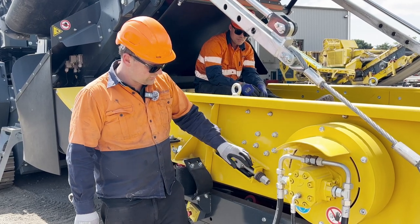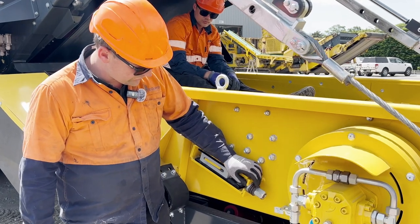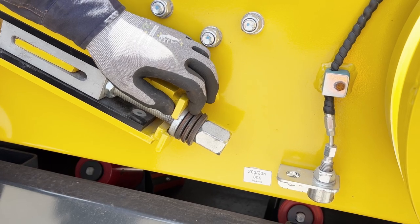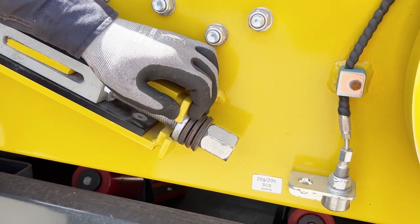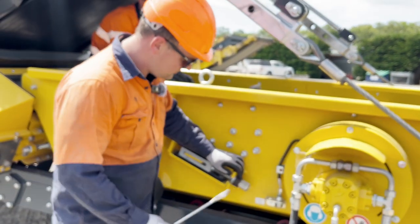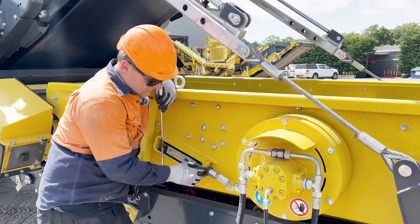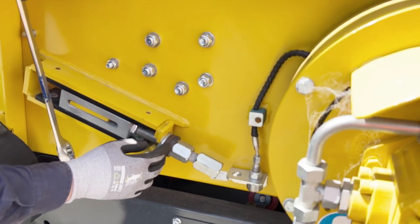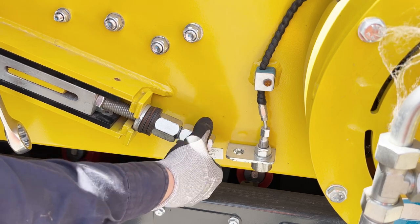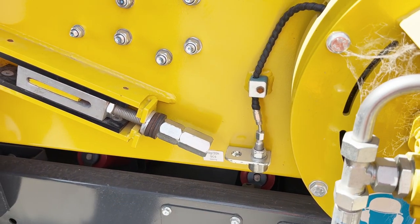Tensioning up the mesh, we're going to use the tension nut and bar. We have conical washers here, which when tensioned to the correct tension, these washers will be flat — they act as a spring washer to hold tension on the mesh. These need to be done up evenly on both sides. Once the tension's done up, you'll notice the washers are all flat and they've taken up the spring tension. We put our lock nut on and our protector, knit that up, and it's done on both sides.